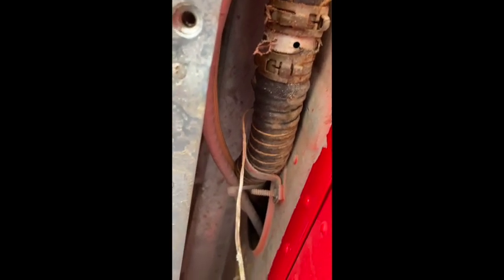Just got the wing root fairing removed on the bottom part. You can see inside. What are the signs of a leak in there? Oh yeah — there's leaking fuel right there. There's the fuel transmitter and the scat tube for ventilation — the black one right there.